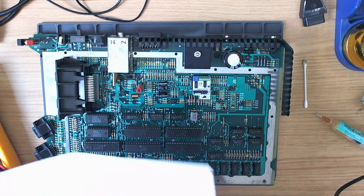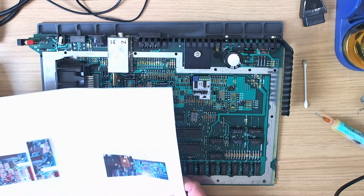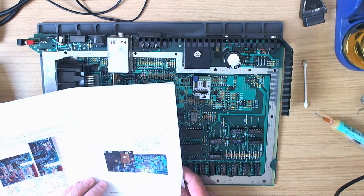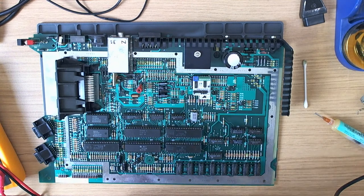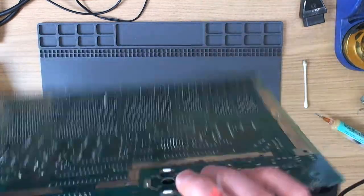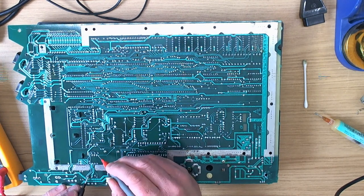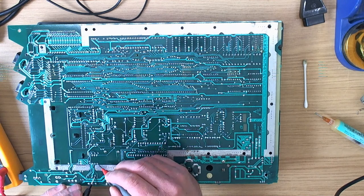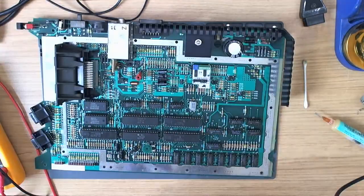Are we soldering these outputs to the back of the coil, or are we just bypassing the coil altogether? I can't remember how we usually do this now. That's very short, the installation guide. I think the assumption made here is that you're going to stick an S video jack on the back of the machine, which is absolutely not going to happen here. So the middle coil is Luma. We've got composite video that goes to the left coil. That's nice and straightforward, and that's all we need really, because there's no path for this one. So if we lift the back of both coils, and see if chat's got anything.